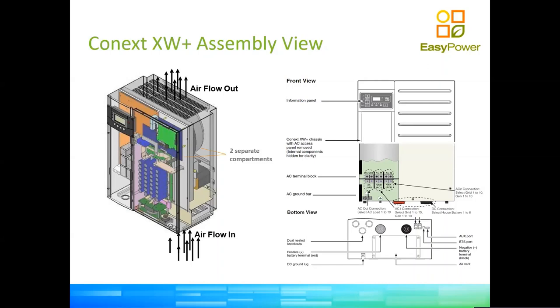At the back of the power conversion section, there is a plate. That plate is connected to a heat sink that goes from the IP65 enclosure into the IP20 enclosure, which is the one on the back with the fans. So those fins dissipate the heat produced inside the power conversion side of the unit. This is done in order to reduce the ingress of humidity and dust to the power conversion part of the unit, which is an enemy of the unit for reliability purposes. The fans are designed to be field replaceable, so a broken fan is not a train smash, it can be replaced. The airflow goes from the bottom to the top. Logically, we want to think that the cooler air will always be on the bottom.